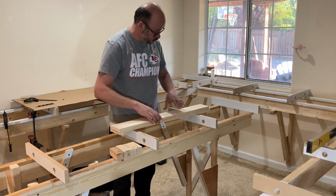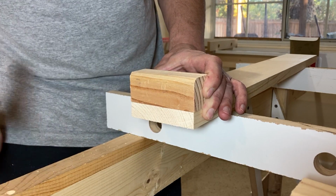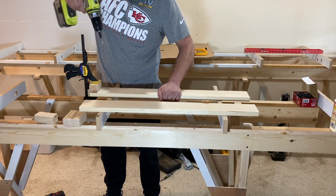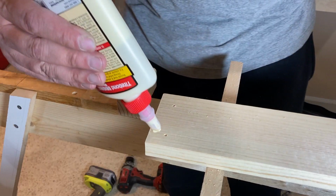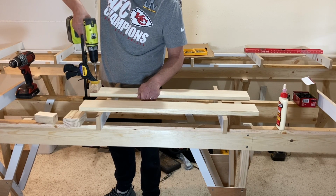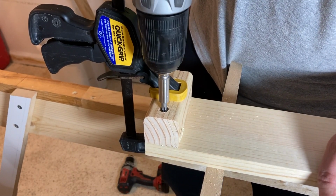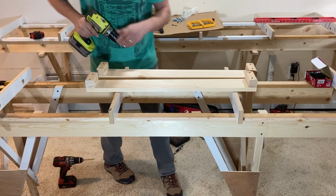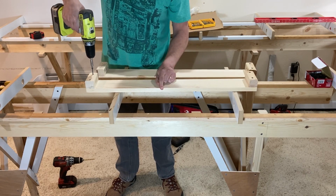This section here on the bottom of the layout will be bolted to the left side and the peninsula. I glued and screwed some 2x2 cleats to the 1x4 webs to accommodate the bolts I'll use to attach these L-girders. After letting the glue cure overnight, I removed the screws. They've done their job, and I don't want to have to worry about running into them when drilling out for the bolts.